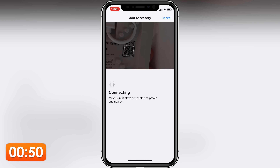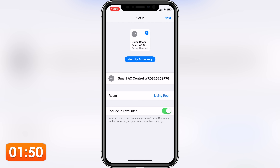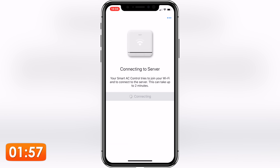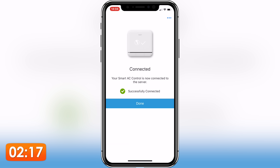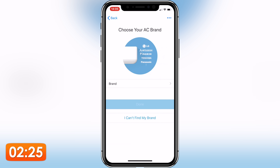Once finished with registration, it's time to include your new smart AC in your HomeKit — grant Tado access to your home data. Now grab your phone and scan the QR code on the back of the smart AC controller with your camera to continue the setup. Once a connection is established, the controller will acknowledge it by replacing the numbers on its display with two arrows. It will then try to access your WiFi, showing a WiFi signal on its display, and once connected you'll get a globe icon. After being added to HomeKit, you'll be greeted with a friendly 'hi' on the display.